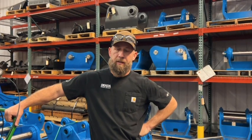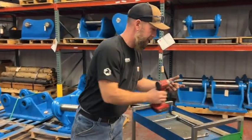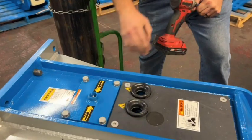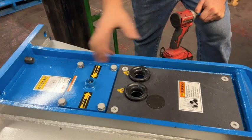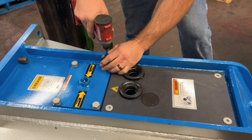If you don't have any pressure in there, you might have bad seals, but we'll just cut to the chase and show you how to do it. Got all my tools laid out here. Start out by taking this grease port off here. You might have an auto lube set up right here - if so, it comes off the same way. Just lay it over here, and this gives us access to the back cap nitrogen port.